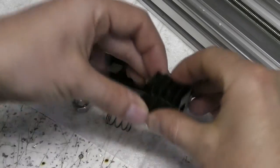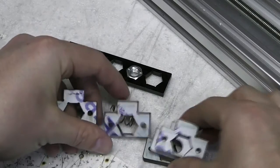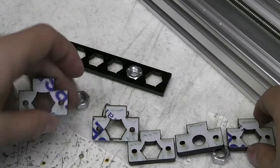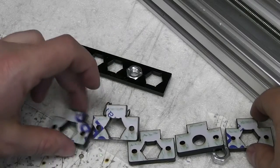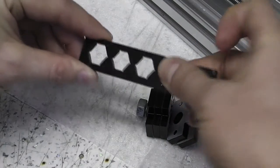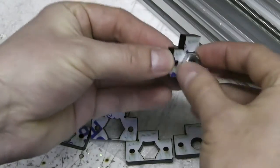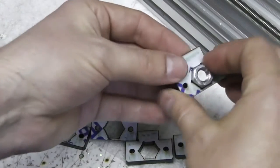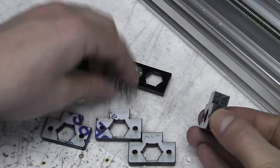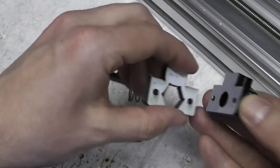The anti-backlash unit is the only part of this which is entirely my own work. It is made from 5mm layers of acrylic. One of them is cut to precisely fit a normal M8 nut. Before cutting the final unit I made a testing strip — that you can see on screen — of slightly differently sized hexagonal holes to find which one fit the nuts I have best. That may differ depending on who made the nuts, of course. The next layer of acrylic is the one that will transfer the horizontal force of the nuts to the body of the machine.